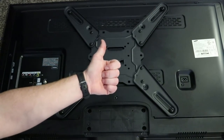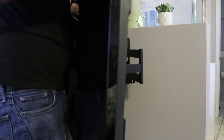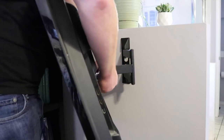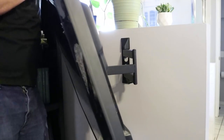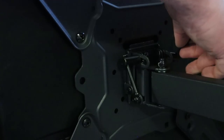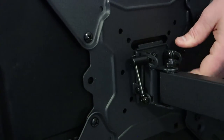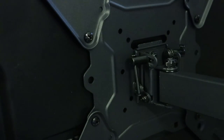Once the TV plate is installed, we're ready to mount it on the wall. You may need two people depending on the TV size. Put the lip on first and it will hang. Then put back in the two TV screws previously removed from the TV plate. Once the screws are on, the TV is now mounted. You then need to align the back — this is how you tilt the TV up or down. Push it to the desired tilt position, and the dials allow you to tighten it up.